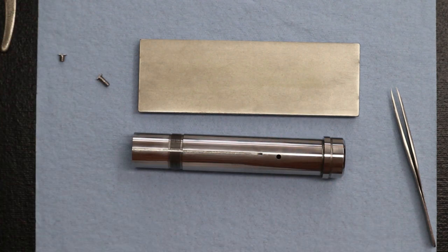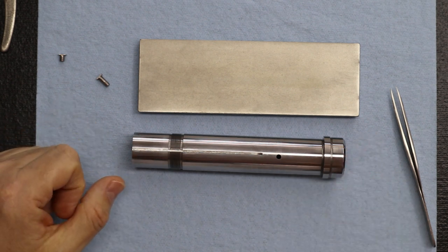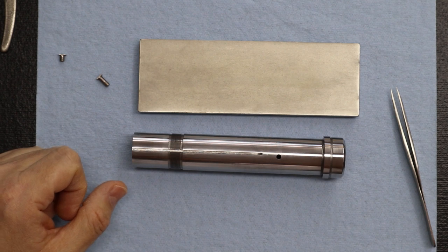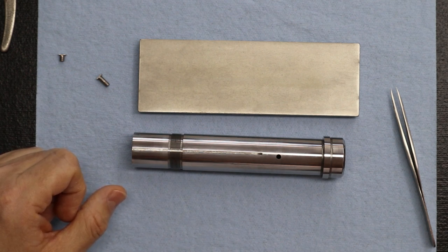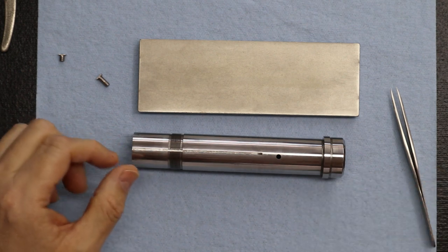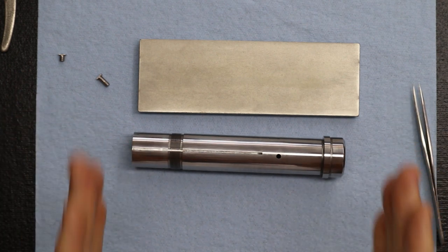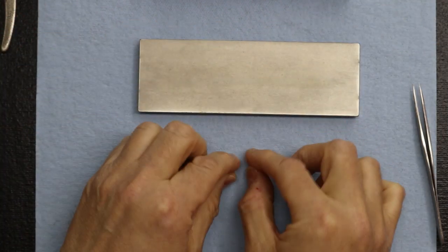So Levin does not rivet. I can only speak for their ball bearing style spindles, because prior to those, Levin's first watchmaker lathes were cone bearings, and I've never owned a cone bearing style headstock Levin lathe. So I can't tell you for sure what they did in that era. But in all ball bearing style spindles, it's all press fit. So we just need to do two things.